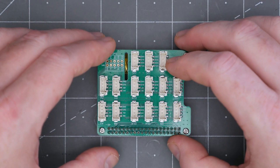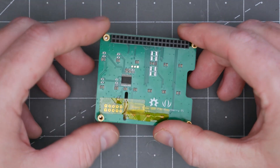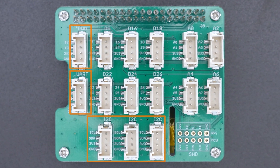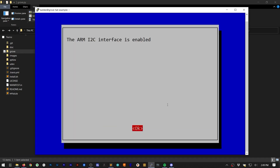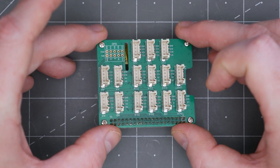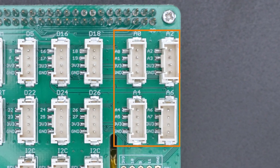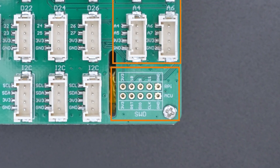The Pi base hat looks similar to the Lotus I showed before — it has a bunch of Grove connectors. There's also a small microcontroller on its back. The ports labeled PWM, UART, and I2C connect directly to the appropriate GPIO pins on the Pi. You will need to enable I2C in Raspi-config before you can use it. Six pins connect to the digital I/O, but heads up: the pin numbers seem to be picked at random. Since the Pi does not have an analog-to-digital converter, that microcontroller provides the four analog inputs, and there is an unpopulated SWD header with three of its GPIOs.